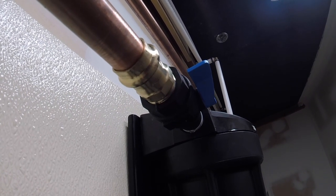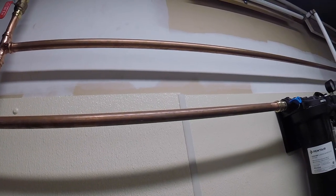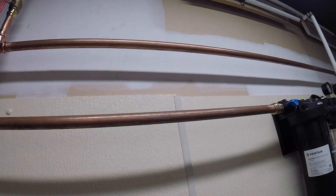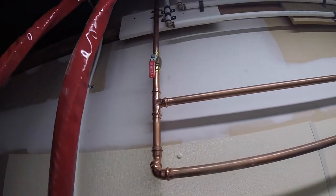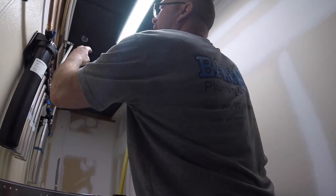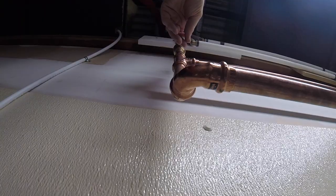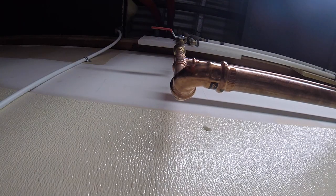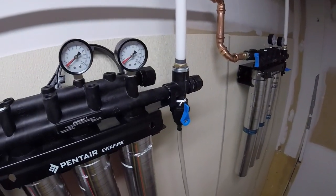There's my little seeper of a leak. I'm going to shut the water off, cut a slip coupling in there, press it back up, turn the water back on. Kind of forgot about it — it's a seeper. We turned that filter off, coming back, drained it out.